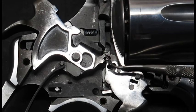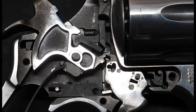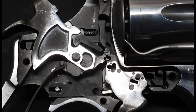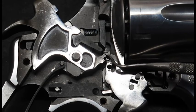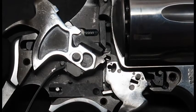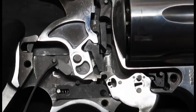Both the angles on the sear notch and the sear nose are precision made. And when you start altering the angles on either part, it will also affect the trigger. In this case, the owner altered the angles on the sear nose and he altered the angles on the sear notch. So what will happen is that you have push off — pushing on the back of the hammer, it will release.